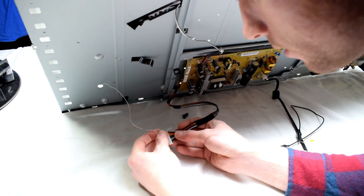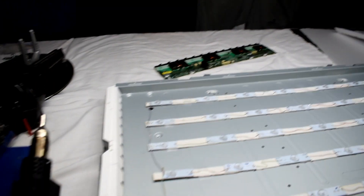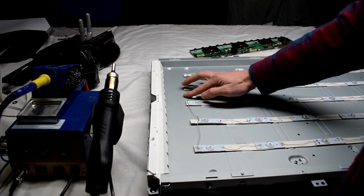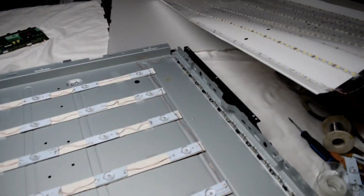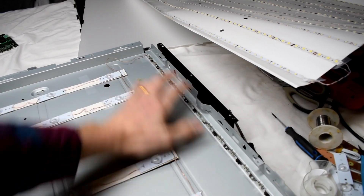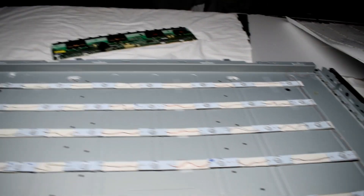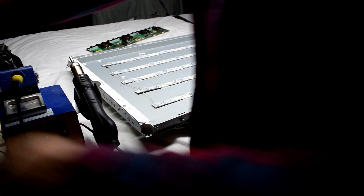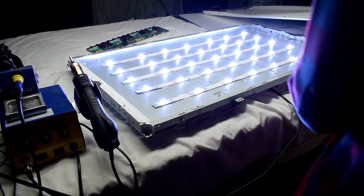I've connected that, so I'm just going to put the wire in the top one — that wire goes there. You can see right here the positive is all connected in parallel, and over here we have a common ground. I've connected that to the base of this TV, so they're all connected there. Let's plug it in — see, it's quite bright.